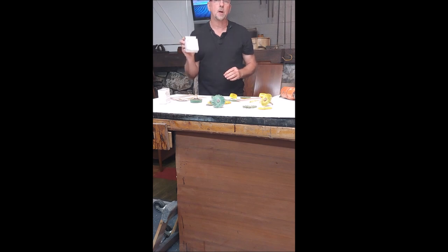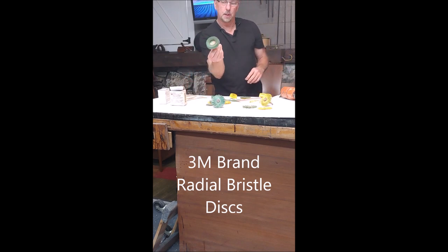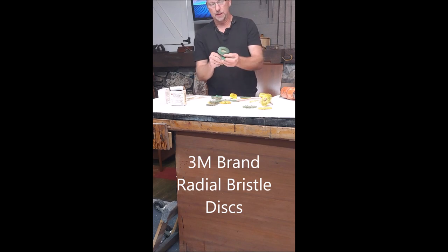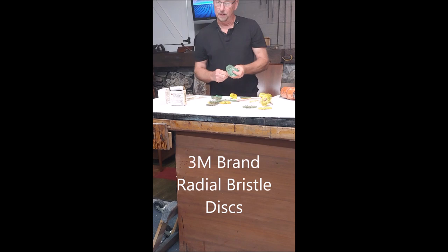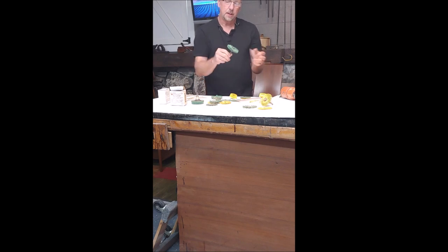So what they are is 3M radial bristle discs and they come in two different styles. One style is this round type and both are kind of round, but they're different, and that allows them to sand differently. This one sands nicely on something like a lion's head, a rounded carving, or a turning on a leg — something that this profile works nicely on — but this one doesn't bend or flex really well, so it only sands certain areas nicely. Conversely, this one gets into nooks and crannies really nicely and sands deeper recesses. So they both do their own thing.